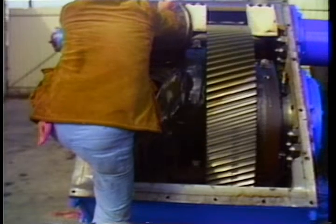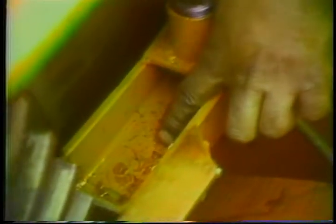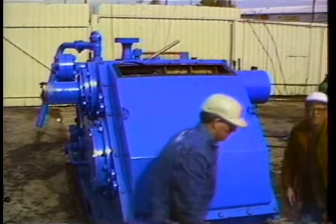Once you have oil in the crankcase, the smartest thing you can do is turn on the oil pump and observe the gear end for oil circulation. You should find oil entering every lower and upper crosshead guide and coming out nipples above the eccentric bearings, as well as some oil dripping from the bearings. This is the best way to locate broken or clogged oil lines and now's the time to do it. If the pump doesn't rely on an external lubrication pump, be sure to fill all the troughs and reservoirs with lubricant so the moving parts will be lubricated the instant you start the mud pump.